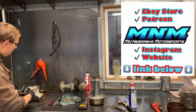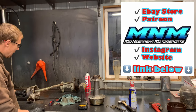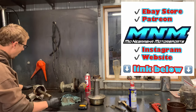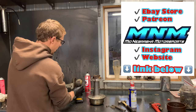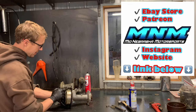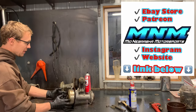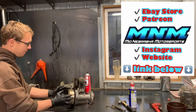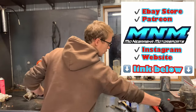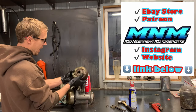The rear end is off now, and I've showed you how to pull that rear end. I've actually disassembled some of it before I started shooting this video. What I've done is pulled the center — I would call this an axle carrier. There's also a brake drum on here, and there's a cover that goes over top. Typically these are going to be a 10 millimeter or a Phillips bolt that holds this cover on. This is what the drum looks like here, and you can tell this one's been pretty rotted out.